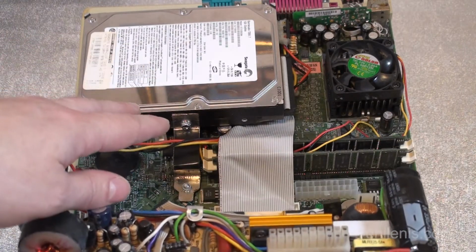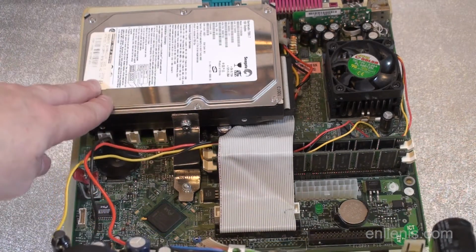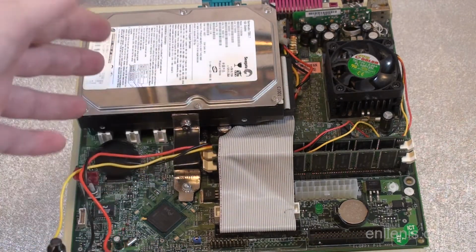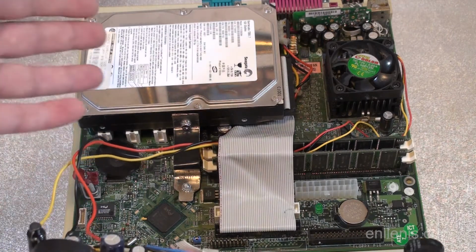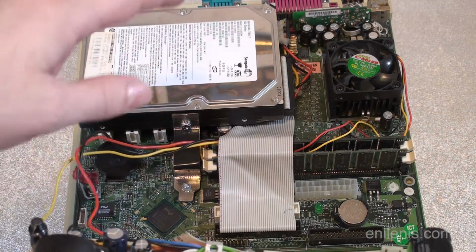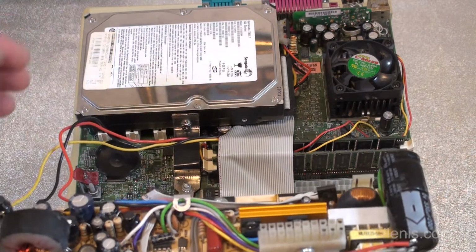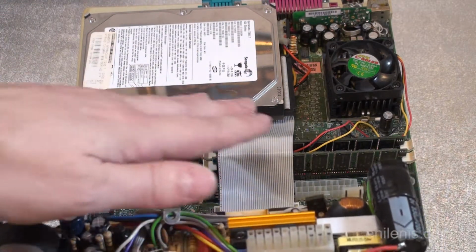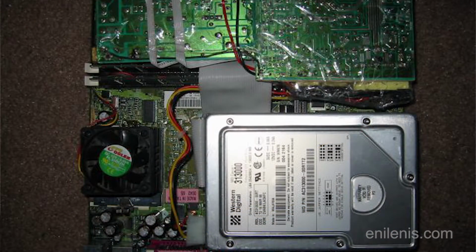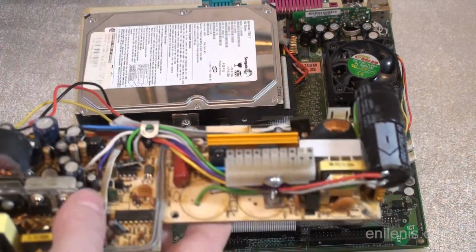Originally, when I was making it, I did something stupid. I used a piece of plywood for insulation, so between the hard drive and the motherboard, I had a rectangular piece of wood just covering the bottom because I was worried about wires getting in the way or maybe some loose screws damaging things. Well, anyway, I did that, and the computer ran for a while. It was absolutely fine until one day I saw magic smoke coming out of the system, and it turned out that by blocking ventilation of the bottom section, I ended up overheating the hard drive, and the lower circuit board at one point just evaporated. So I fried one of the hard drives, and this is the second one that I'm using.